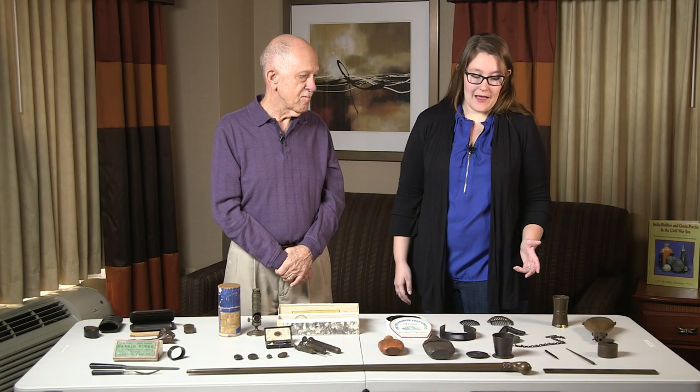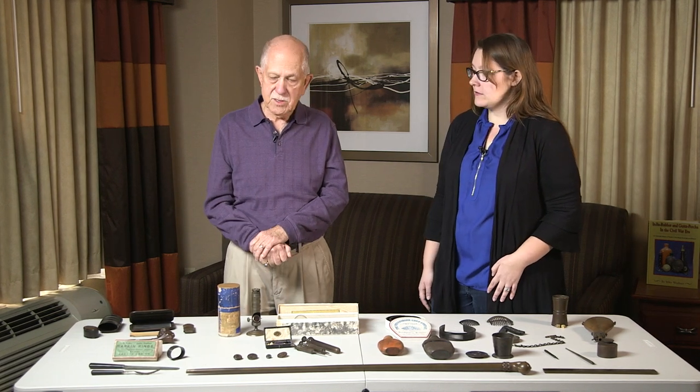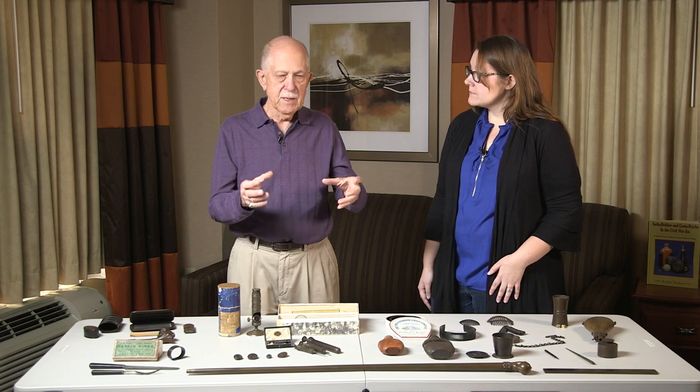So that's really allowing for pretty much all of the objects on this table to be made. And I think an important point is when people think about molding, they're thinking about pouring latex into molds. Hard rubber is not created that way. It's taking vulcanized rubber sheet with more sulfur and basically pressing it into the molds.